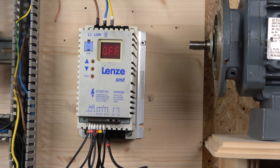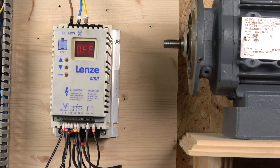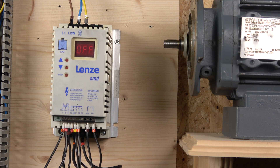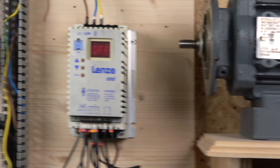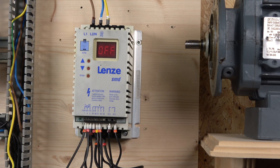That covers the two-wire control. Now let's get to three-wire control. For three-wire control, we need to get a little bit creative. We're going to use a digital output to allow us to start the drive and keep it running — effectively creating a latch. However, as it stands, there's no way to natively program three-wire control from the configurable inputs inside the drive, so we have to compromise.